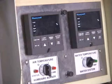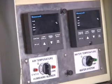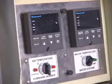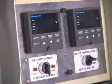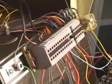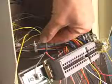Avoid mounting this sensor so that it points upward, as this can cause premature failure from condensate collecting in the tip. The temperature control assembly for the Humidaire unit is normally mounted in a convenient location for the gin operator, away from the Humidaire unit. It includes 2 digital temperature controllers, a start-stop selector switch for the burner, and a selector switch to enable the water pump.